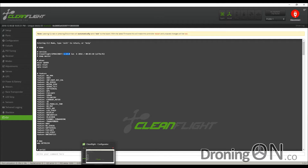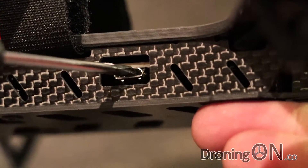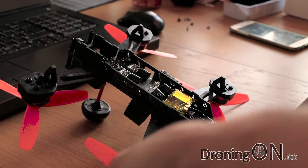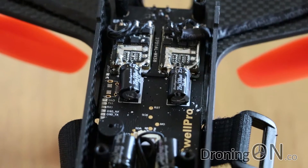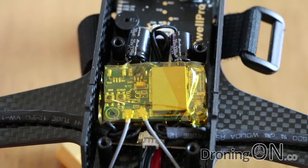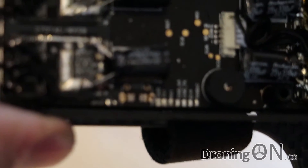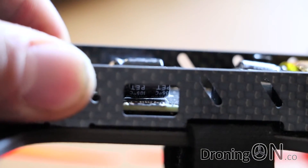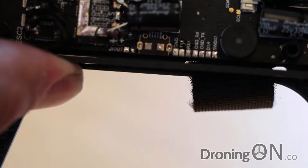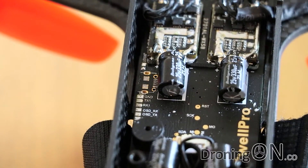At the point of unplugging the USB cable I discovered a problem - my USB port had actually become loose. I undid around six screws underneath and removed the underside cover to reveal the interior, where I could see the two front speed controllers, the 2.4 GHz receiver, and the rear LED light PCB all neatly installed inside. At that point the USB port actually dropped out. Looking at the PCB, minimal solder had been applied to keep it in place. I verified this with SwellPro and sent them this video - they confirmed they immediately asked engineers to investigate and check current stock. The ports on those in stock were well secured so I think I was simply unlucky, though it shouldn't happen on a $600 quadcopter. SwellPro took my report very seriously and responded very positively.